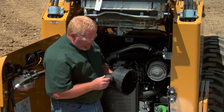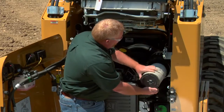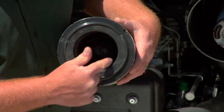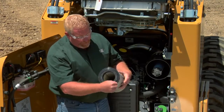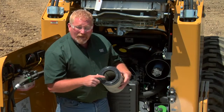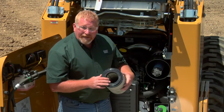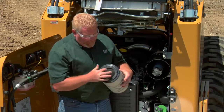Now this machine's new, but the principles are still the same. This air filter is a radial seal air filter, so you just give it a little bit of a wiggle when you're pulling it out. It says radial seal on it, and the reason why it's radial seal is because it seals on this inside diameter. The reason why we went to this style of filter, as opposed to the old filters that sealed on the outside diameter, is it provides a much cleaner joint. For example, if our air cleaner cover came loose for some reason, this filter is more likely to stay in place and continue to filter as long as we've got a good continuous seal.